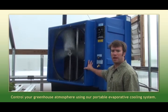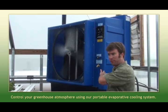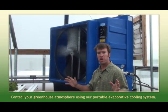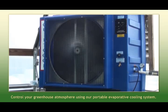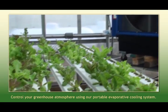This system has cold water coming into it and it trickles down through a pad, and the fan draws that cool air out and into the greenhouse range. The increased humidity along with the cool air helps us to grow crops that like it a little cooler, such as lettuce.